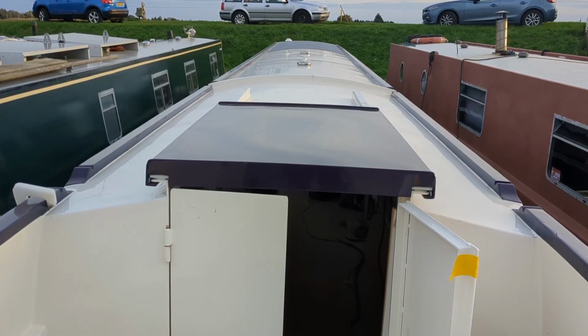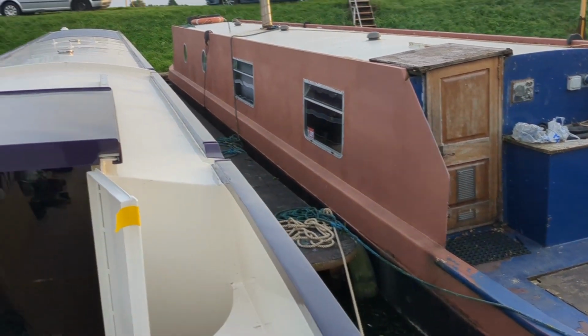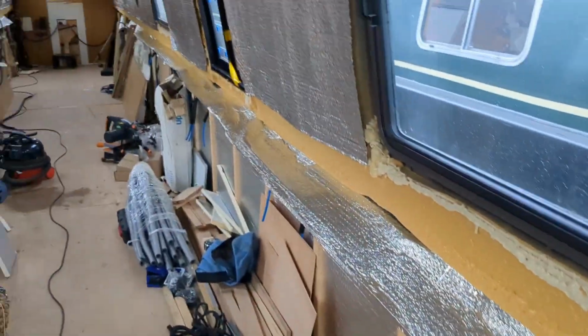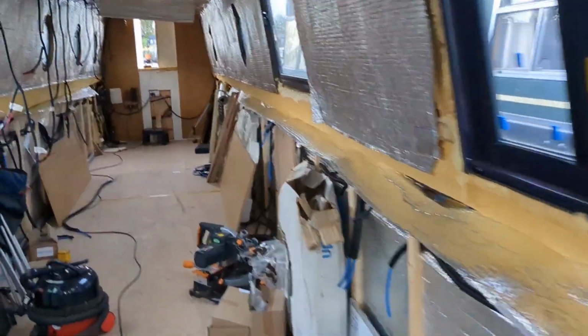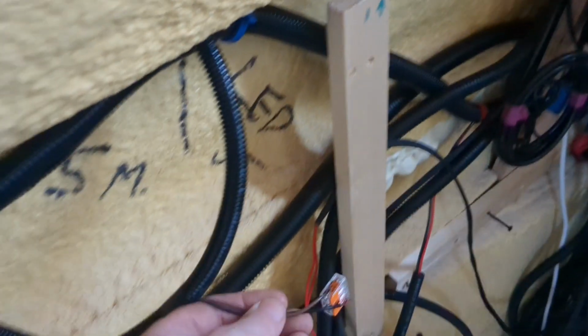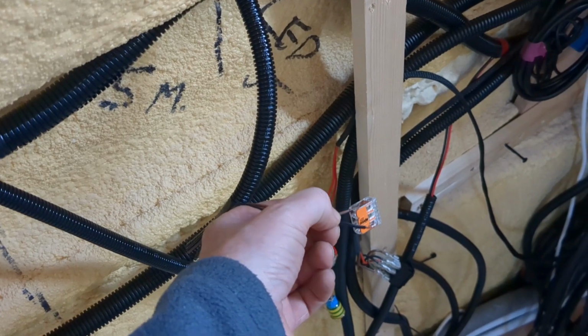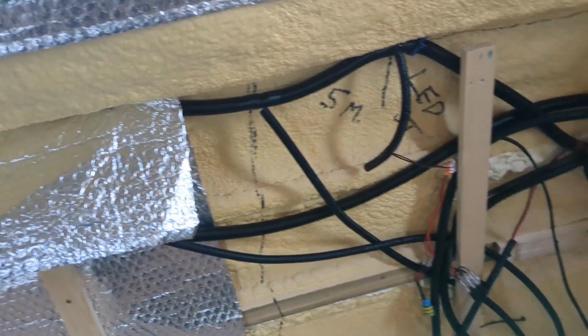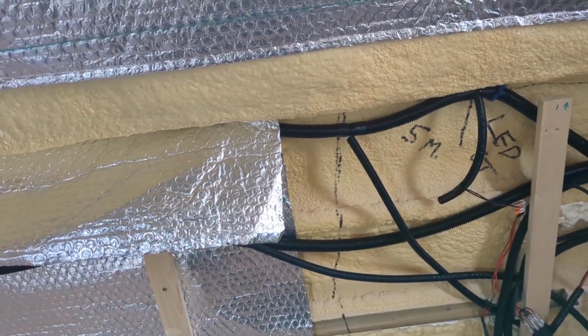So lessons from today include always put your knee pads in, and the other thing that I learned today was always clip off or protect the other things in the circuit. Having made all the circuits live, this was shorting when I was turning the circuit on. So there's a top tip. I blew a couple of fuses before I figured that out, but that was a useful lesson to learn.